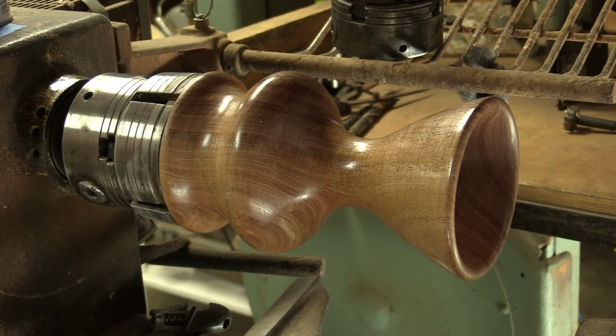Probably 15-20 minutes, I'll be back with you. And we'll feel it, and then we'll put on, like I said, another 2 coats. Now I'll probably lightly steel wool in between. We'll find out with 4/0 steel wool to help build the finish to where it's nice and smooth and it doesn't have any roughness to it. But I'll be back with you here in a minute when it dries.